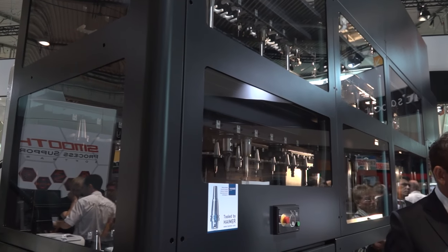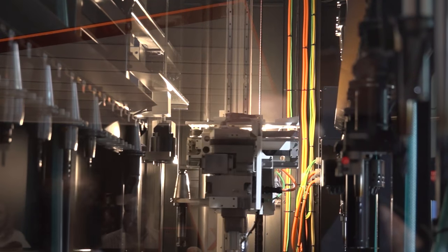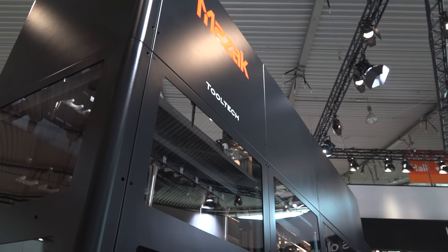That's quick! Yes, it's very quick. It's quite a unique design because we've compartmentalised the tools according to diameter and length. You can put a tool up to 350 mm in diameter, a T-bar up to 500 mm, and for our largest horizontal we can accommodate a tool length up to 1,000 mm. The weight-bearing capacity for an individual tool is 40 kilos with a moment of force of 80 newton metres. I've seen similar systems from other manufacturers but they're much bigger — this is quite a compact footprint. Yes, this 206-size Tool Tech occupies a smaller floor area than a 120-tool chain magazine.